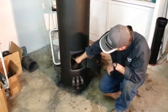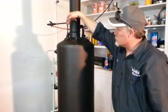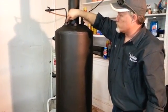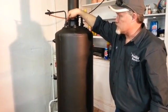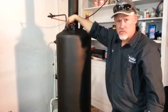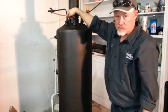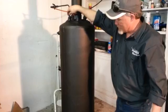On this side, we have our oil drip, which is coming from here and goes all the way down the water heater. We went from a three-quarter down to a three-eighths fitting, put our pipe, and drilled the fitting of the tube fitting out. It's just regular brass tube fitting for copper — we drilled it out and ran our copper straight through it. Otherwise it's going to get stuck. You just take a drill, drill right through it, and you get rid of the little ridge. The copper goes straight through it.